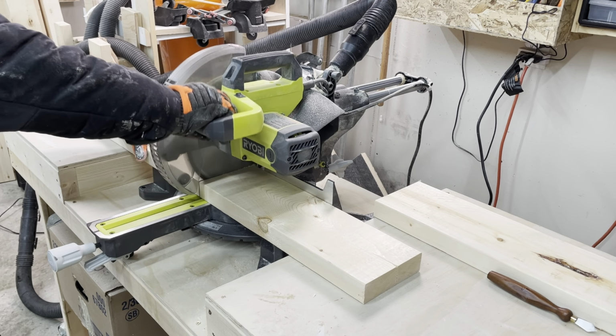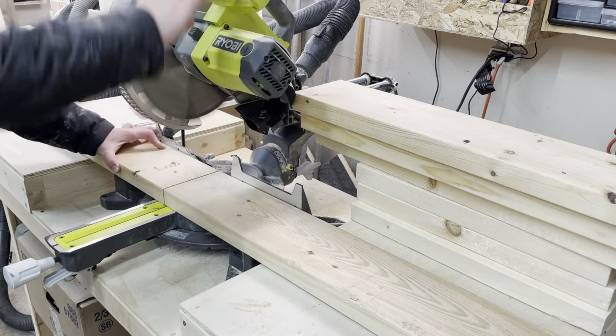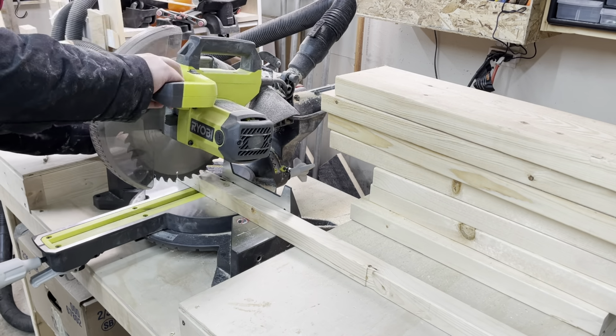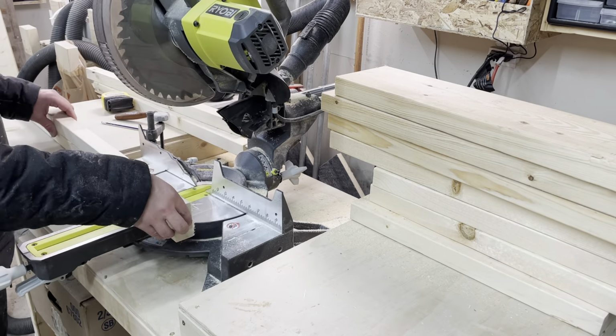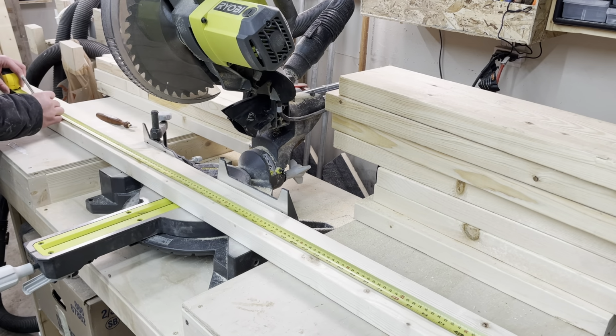As always, the first step is to cut all of our pieces to length. I'll leave a link to the plans in the description so you can follow along as well. To make your cuts a little more accurate, I recommend a marking knife instead of a pencil. I just recently switched to this and I'm super happy with the results.